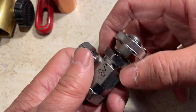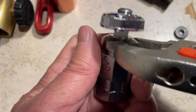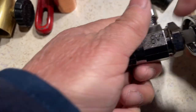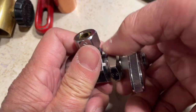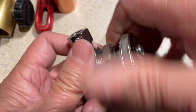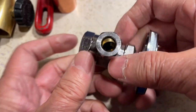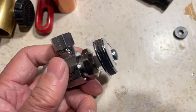To replace the washer, just use a wrench — you might need two of them — and just unscrew this. You might need two wrenches when it is on very tight. That's all you need and then the whole thing comes out. When you do this, you'll probably have to turn off the water supply coming into your house or apartment.